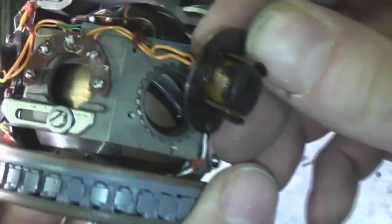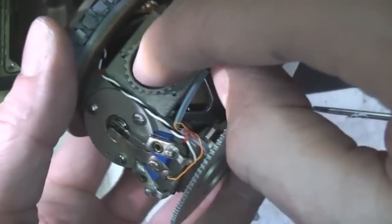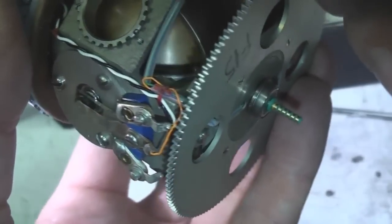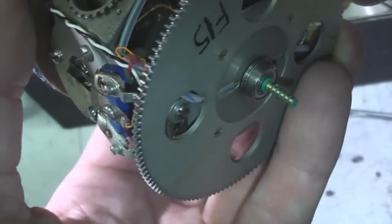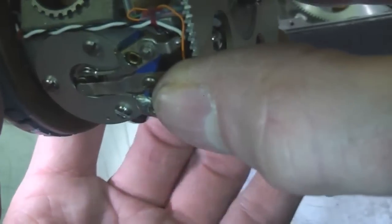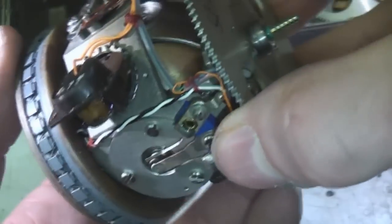Right, these look like they're just little coils, but there's a shaped piece, so it looks like these are designed to go very close to this rotating gyro part. I can only imagine that's some sort of eddy current drag type thing. I'm not really sure what that would do. I'm not sure whether that would be sensing or whether that's more position control. Yeah, there's this induction motor to move it this way, but there actually isn't anything, I don't think, that's moving it in this direction.